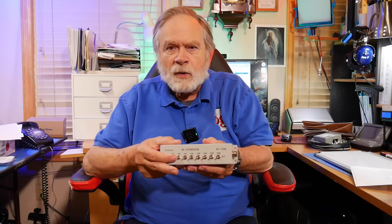I've got a signal generator and an O-scope, and I can very quickly tell how much attenuation is built into these various switches. The idea is that various combinations of switches can create any amount of attenuation that you want — everything from 1 dB up to 20 dB, 40 dB, 60 dB, 70 dB, and then minus 6, 3, to get 80 dB, and you can put in one more to get 82 dB at the max.